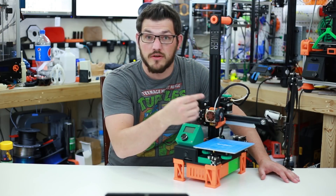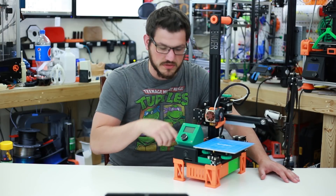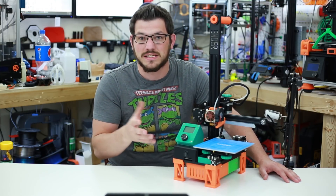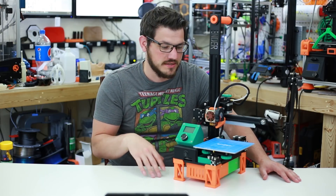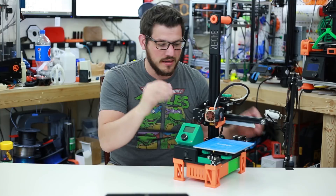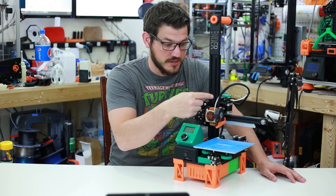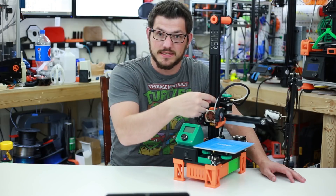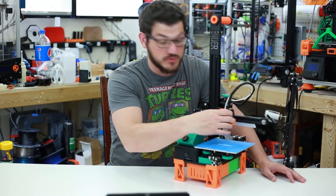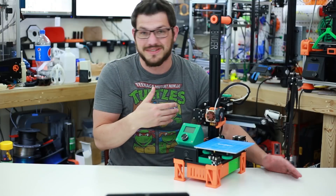This adds a 50x15 fan right onto it. There are actually ports already on the board — it's just not wired up. Run some wire down to that, plug it in, and you're off to the races. It's a 12-volt PWM-enabled fan so you can set it in your slicer. I usually run it at around 80–90% for PLA and 100% on bridging. It's fully adjustable so you can slide it up and down to get it just above the nozzle so it's not blowing on the heater block. It also includes cable support — your cable routes through and zip ties for stability, preventing cable fatigue and keeping your Bowden tube nice and straight. Everything here is printed in PLA and it's been working fine for several months.